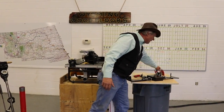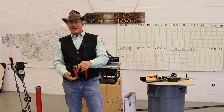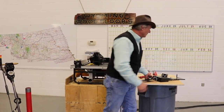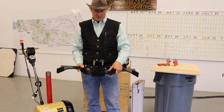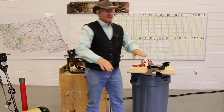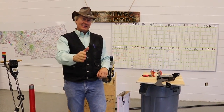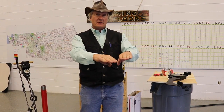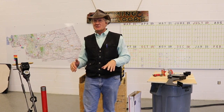We also made this little front hitch apparatus, which has been invaluable to us, holding those machines absolutely straight going back and forth down the gymnasium. I have a complete rear hitch system that we developed as well — these are things anybody could develop on their own. The key feature is these threaded pins: when you get these machines to toe in slightly, they track much straighter down the gym and back. With the old Floor Style system that attaches only to the rear, if you toe them in and reverse, they want to open up and squirrel all the way back, requiring a lot of effort from the operator to keep the machine going straight.